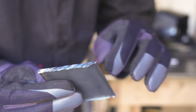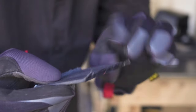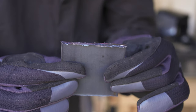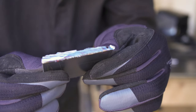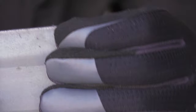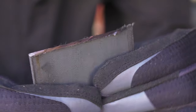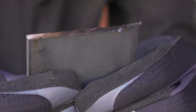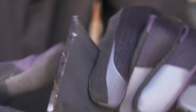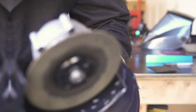Okay, the second cut. It kind of does the same thing — it really melts the metal because it gets pretty warm. I thought this type of disc would do more of a cutting action; it did not. You see that? That stuff is on there like it's melted off. This time I got a better angle so I could see what I was cutting a little bit better, so I held the disc a little straighter. But this still looks like it's melting and grinding through as opposed to cutting through.